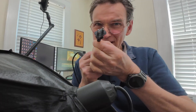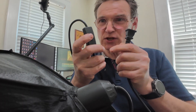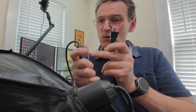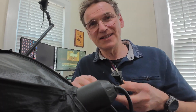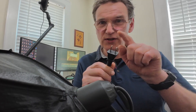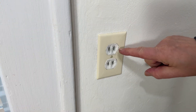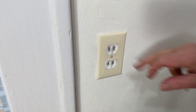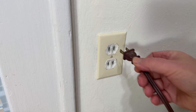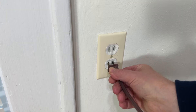Here's why it's important to have the right polarity on a plug like this: if you have any device which has a switch on it, that switch will be switched using the hot terminal. Otherwise, when the switch is off, the device may still have power. Here's an old outlet with different size slots, and here's an extension cord with different size prongs — you can only insert it in one direction. We actually have two issues with this plug board: polarity and protective ground.